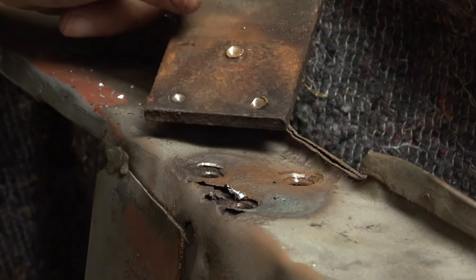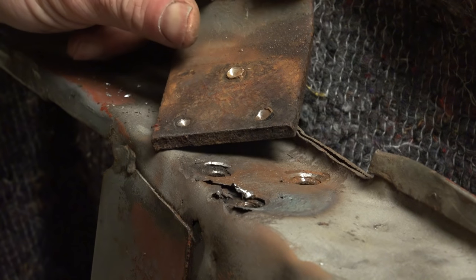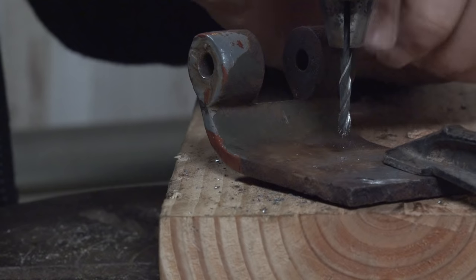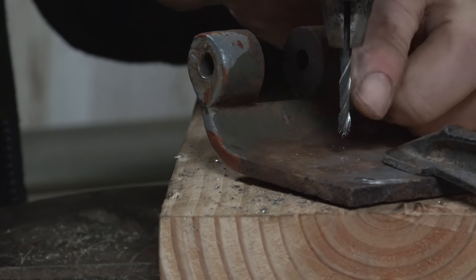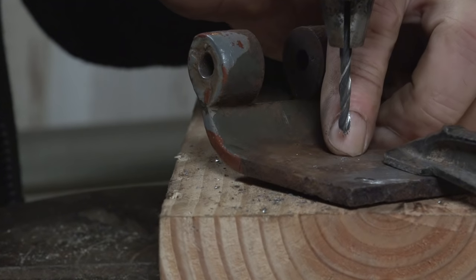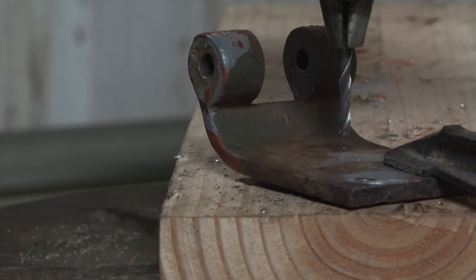That's it - we still have to drill those holes out but that's easier on a column drill. The key point is: if you have to drill out broken bolts, don't use a bit that's too big or you'll damage the thread. Grind it flat first, make sure it's a flat surface, use a center punch to mark the center of the bolt, then use a bit that's a bit smaller and gently drill it out.